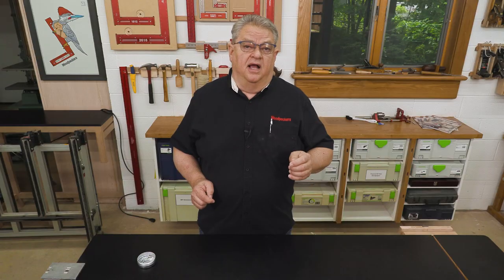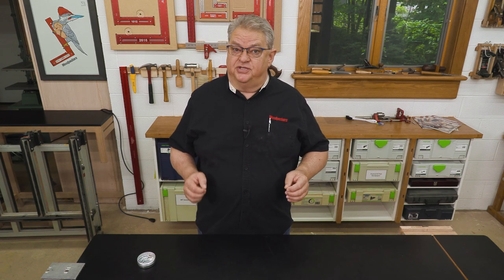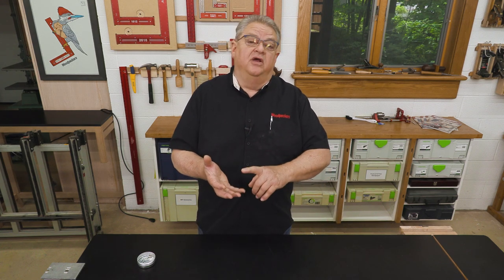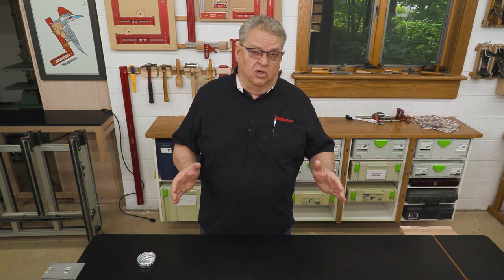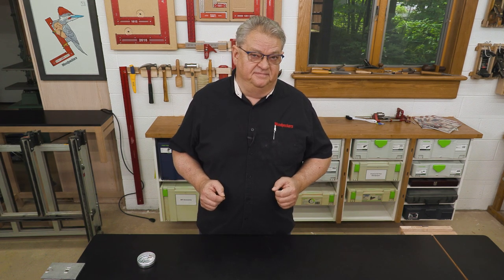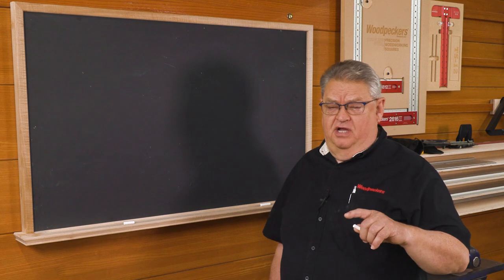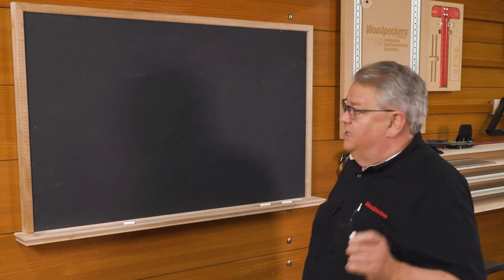If you're matching existing cabinets you probably want to go with quarter inch. If you're doing something new, that's when you might want to try the metric hardware. Today I'm working on a new piece of furniture — a little shelf unit I'm building for our sunroom. It's new construction and I've already got some five millimeter shelf pins, so I'm going to use metric spacing with metric hardware. I don't know exactly what my cabinet looks like yet, so let's go over to the chalkboard and take a quick look at where I am in the design process.